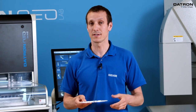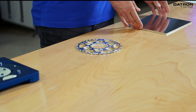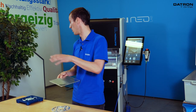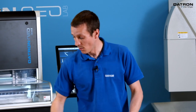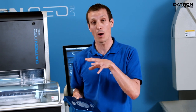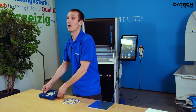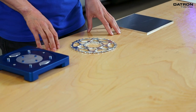So how do you clamp this, especially when you want to flip the part? The first side is quite straightforward: we use an aluminum plate, put it on our vacuum fixture, on our vacuum bed, on the standard table, and mill it out. But for the second side, we have created a special fixture — a combination of mechanical work holding and the power of vacuum. Let's see the first operation in the machine now, and once we finish, we'll take a closer look at this fixture.